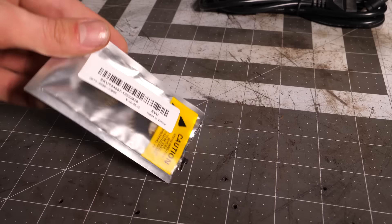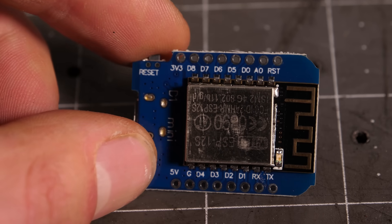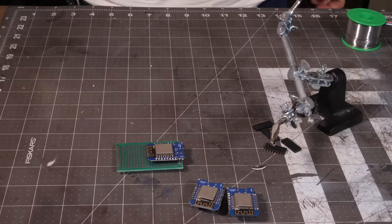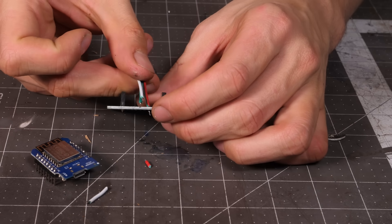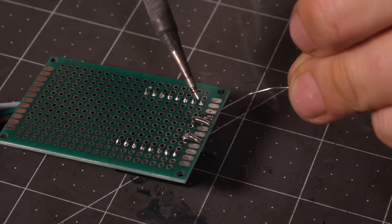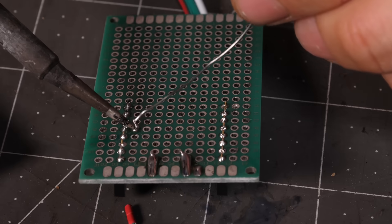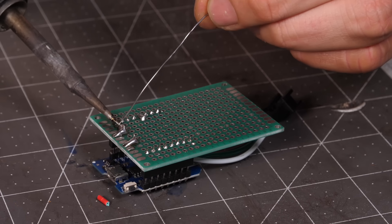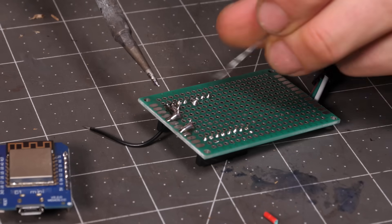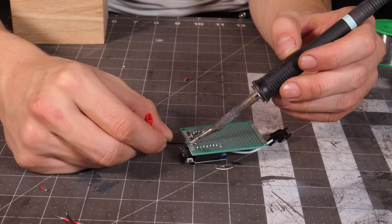I want the lamp to be wirelessly controlled by a microphone centerpiece that can be moved around independently, so these lamps need to be able to pass some messages. I'm using the Wemos D1 mini WiFi board because of its convenient small size. I will add a schematic for the soldering in the description, but here's the quick rundown. I have an LED connector that connects to the LED strip inside the aluminum channel. I solder the positive and negative wires to their own solder pad on the perf board where I will later connect a power source. Next I connect the green data wire to the D2 connector of the WiFi board. I solder a path for the positive and negative from the big solder pads on the perf board to the 5 volt pin and ground pin on the Wemos so that the board is powered. Lastly I solder a connector to the solder pad that will later be used to power the entire thing.